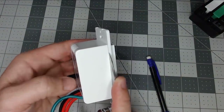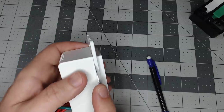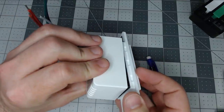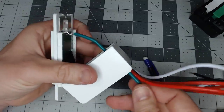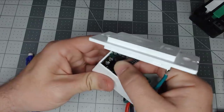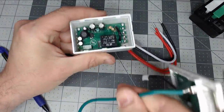There are no screws on this switch to open it. You need to take a blade or use a spudger — as you're supposed to instead of a blade — and pry it apart. It simply pops off; there are three clips on each long side. Just pry on the long edge and it pops right off. Feed the ground through, the faceplate splits in two, and there's a little slack with the control wires that connect the faceplate to the rear. They've given us a plug inside — simply pull and unplug it, and the faceplate comes off.